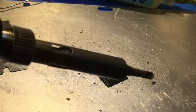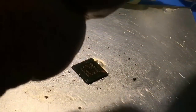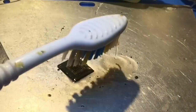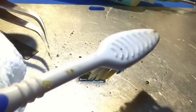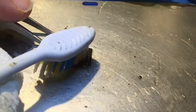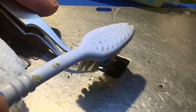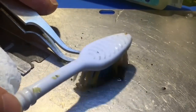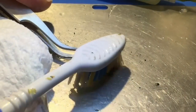That looks good. I'm going to do one more cleaning with isopropyl alcohol — IPA. It's important to keep that chip flat because if it bends at all it could crack and then you could end up with no recovery. This is for a photo and video recovery from an LG G4 that was stuck in a boot loop.